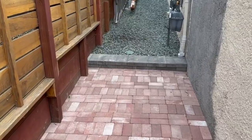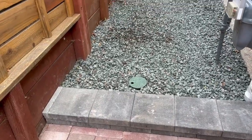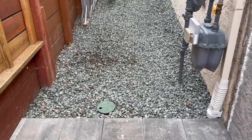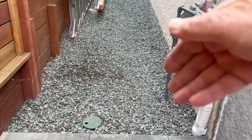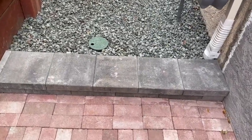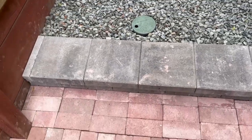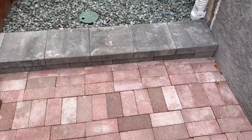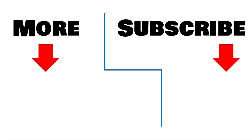Glue the blocks together, backfill, and the steps are complete. I've got the pavers all in place, glued together with the paver adhesive, and backfilled with crushed rock, which goes on top of the French drain that runs right alongside the house. So now we have a nice transition from our brick pavers to step up — it's only about four or five inches. So another project done. Good luck if you choose to do something similar. To view more of my videos click here, and to be notified when I release a new video, click here to subscribe to my channel.